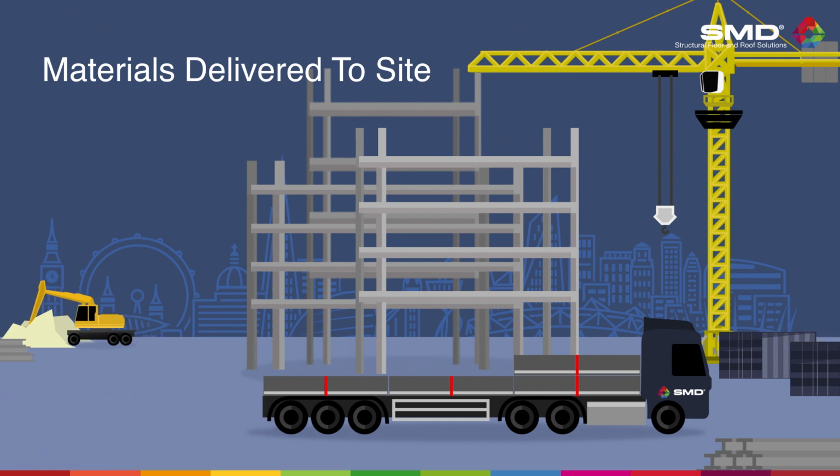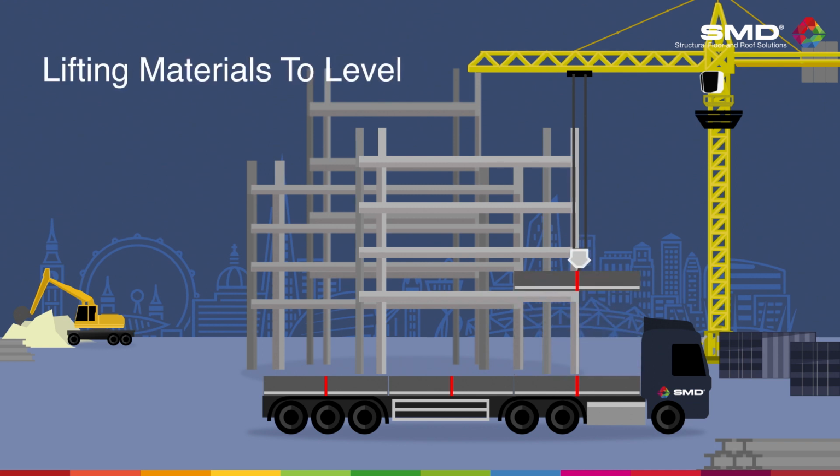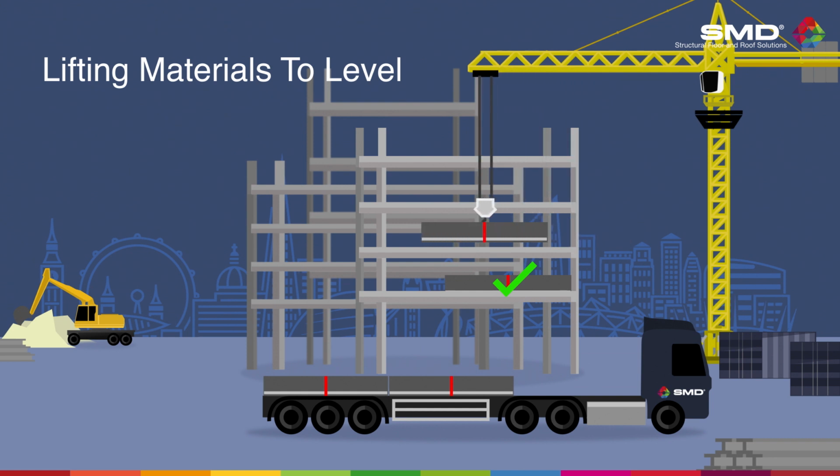Deliveries should be requested to arrive on site as the steel frame is being erected to allow for the effective distribution of our materials. Once our materials have arrived on site, the client will need to arrange for the materials to be loaded out and lifted to level in accordance with SMD drawings, showing the pack position and orientation.